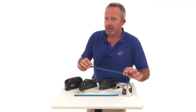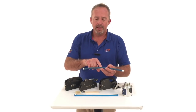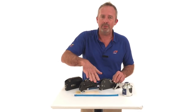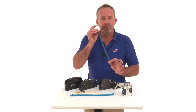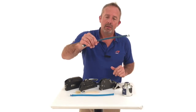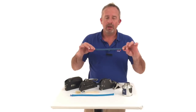If you've done all of those things, you're going to have really well-performing halyards. If you're racing and really abusive to your lines, you may need to move to a blended high-tech cover — polyester blended with Technora, PBO, or Kevlar. These hold up to abuse — maybe you can't always take the load off and you blow the line — and this cover will last longer than a straight polyester. For racing, if you need the performance and don't mind spending the extra money, a blended high-tech cover is the way to go. These are very tightly woven, and the jackets and cores are already kind of bound together, so you typically don't experience cover slip on the cores.